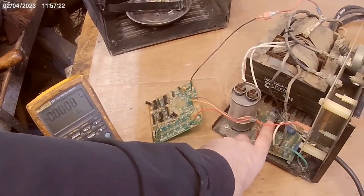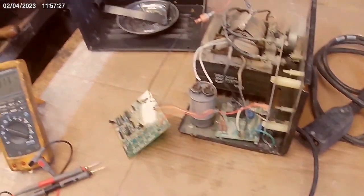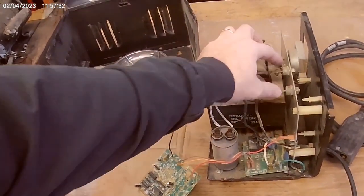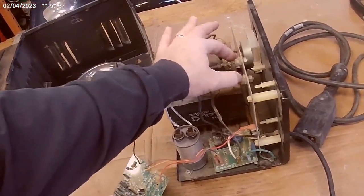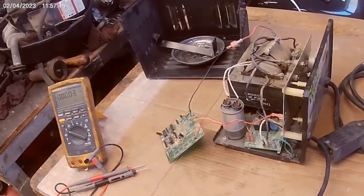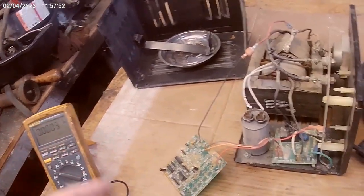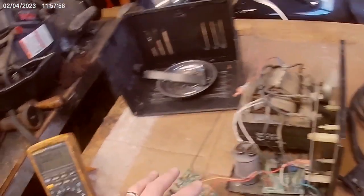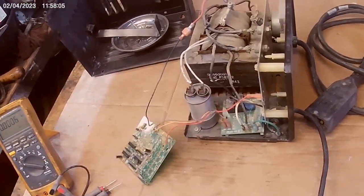When I started looking for the schematic for this thing, I found online an upgrade kit that basically has one board replacing these two. When you add that to cart, it also adds these two diodes and this fuse as well. So I ordered the parts — it was a lot cheaper than even just buying the schematic to try to fix the board. It was actually cheaper to buy all the new pieces. The relay, the voltage sensing circuit — everything is all tied into this one upgraded board. Let's swap the pieces out.